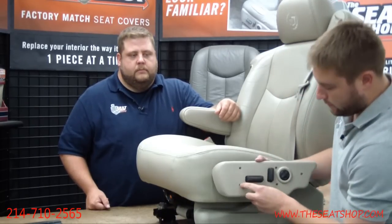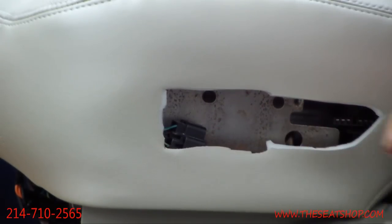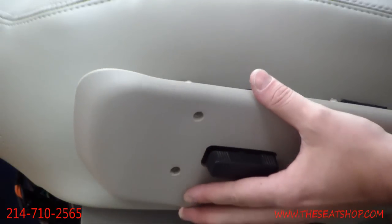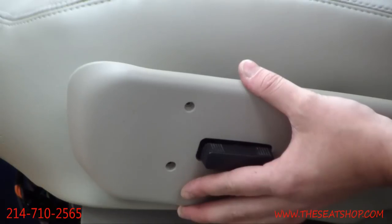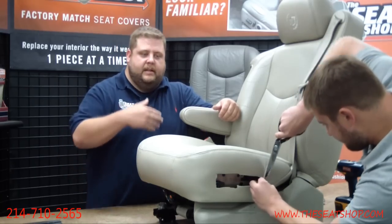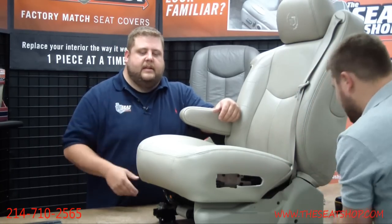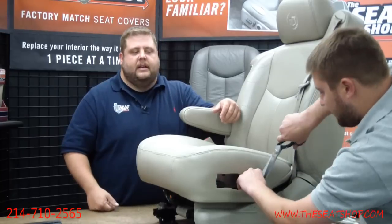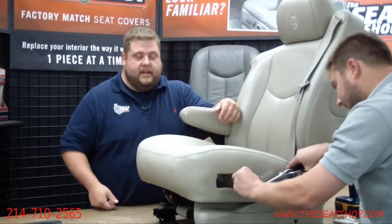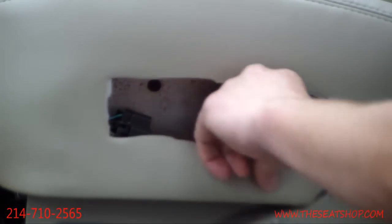Your screw holes right here — you'll be able to see the post. You can also look behind here once you get a little bit started to see exactly where those screw holes are. Just line it up there and look forward and back, saying okay, I need to cut another inch or so. Sometimes I may pick that panel up 15 or 20 times, hold it up there, and make a little cut — a half-inch at a time, put it back up, cut a half-inch at a time. Just little pieces. If you feel like you're holding it up a million times, that's fine. Just take it up as many times as you need to make sure you've got the right spot.